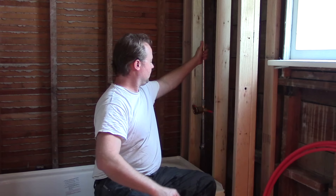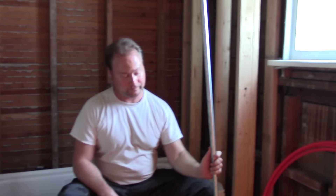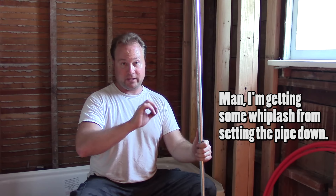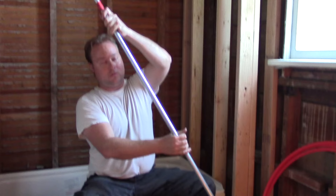You can see it's going to fit right in there. We need to put this in place — have someone help you line it up height-wise. Center it with the tub. If you're doing a shower only, figure out exactly where you want it. With a tub, the center of the drain hole lines up left-to-right with the center of the faucet handle. Have someone hold it up there, get the exact place, mark it. You need two boards mounted in — a two-by-four or two-by-six — one for the shower faucet and one up higher just below where the elbow is for the shower head, to keep the pipe from shaking.